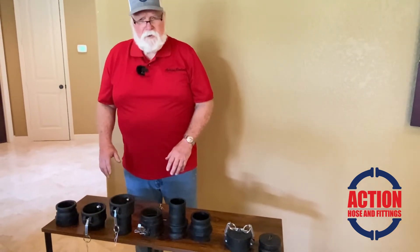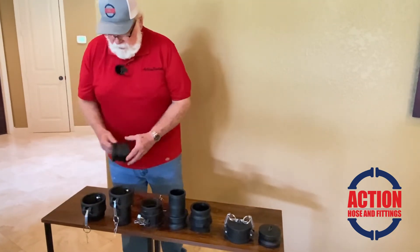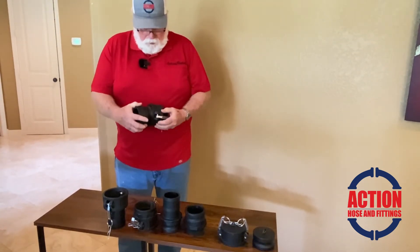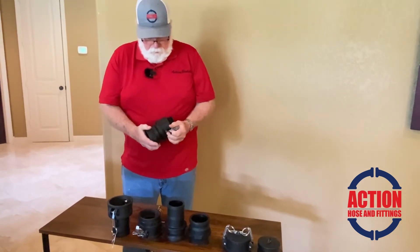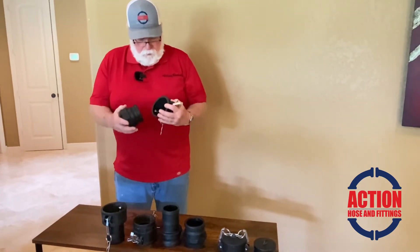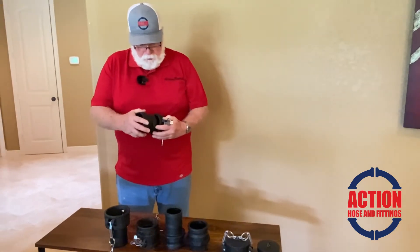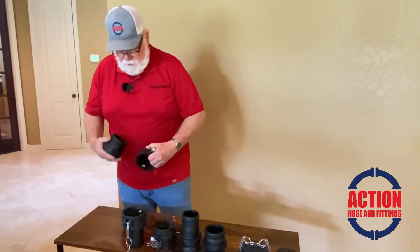Basically they're the same size, the same numbers. They all have gaskets that they seal against. As I showed you on the other one, you can put one together, flip the clamps down, flip them back up and lock it into place. Now they do not seal on the OD — the cam lock swings in until it hits the rubber seal area and seals against it.